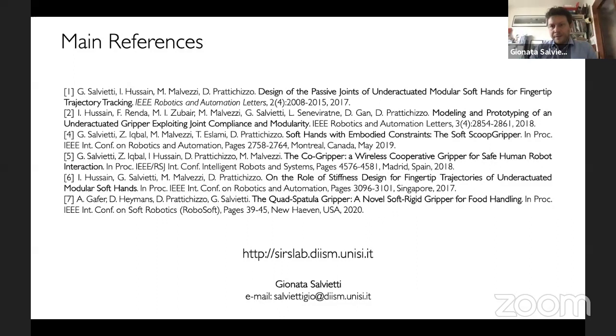you always have the problem of having a very precise alignment for the closing, because there are many parameters that you cannot correctly model, and there are errors while sliding, and there are many things that you have to take into account. And this idea of having magnets, I think it's really nice and can be extended to a very wide range of problems when dealing with these soft structures, because as you were saying, it's a kind of robust approach. And of course, in the case of the gripper, you have to consider that you also have to release the quad spatula.